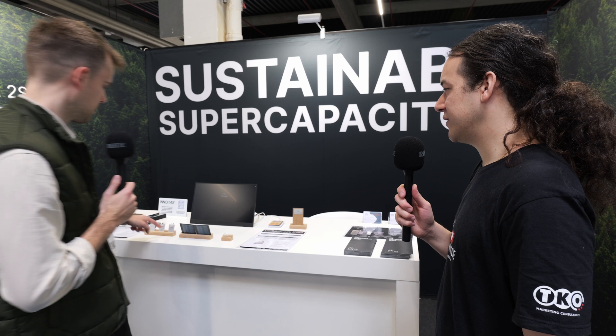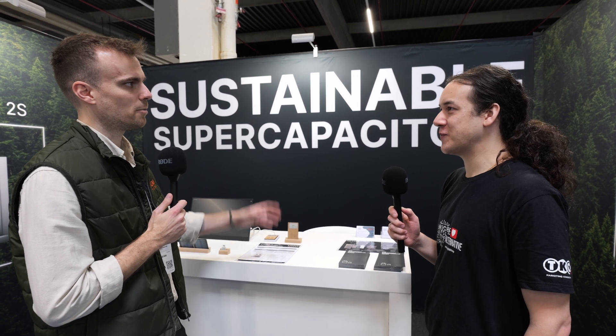This design is a bit too big — it's based on 1.2 farads. We'll probably build one with lower capacity just to make the harvesting go faster, filling up the cap more quickly. The card application is interesting, and we've looked into antennas sending out high amounts of energy. In Europe the regulations are quite limiting, but it's thrilling to think of making it work for both logistics and for rooms like this. There are a few American companies doing this with high amounts of energy, but in Europe we'll see how it actually works.